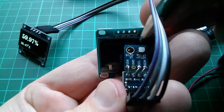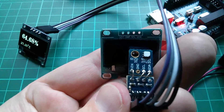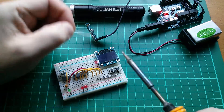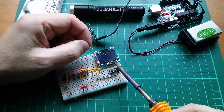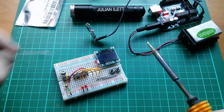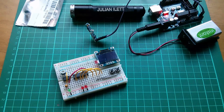Here it is: VCC, ground, SCL, SDA. Let's remove that humidity sensor from these bits of wire and solder it right onto the front of this OLED display board, whilst also attaching the supplied 4-pin header that came with the OLED. I'm just going to use this old board to mount the OLED so that I can solder these pins. I don't want too much excess solder here — I want that to soak in to the through holes. I'll put a little bit of solder on the middle too.